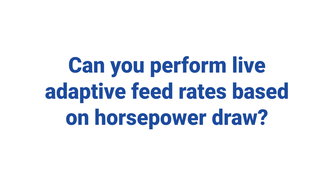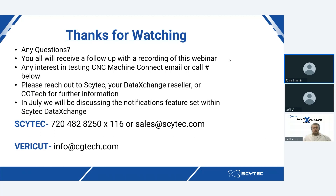Can you perform live adaptive feed rates based on horsepower draw? Controlling the machine is not something the Data Exchange product focuses on. It's not supported by all machine types and it's not something we recommend doing from a product standpoint at this time. But we can monitor those things and make it very transparent on the shop floor when something's going awry. If the machine goes into alarm, you can display that data instantaneously on a real-time view display mounted throughout the shop floor, or on something we call the ODI — operator data interface — which can bring attention to issues that might be going on with that machine at that time.